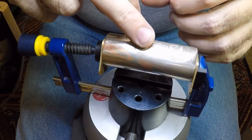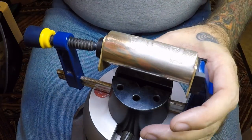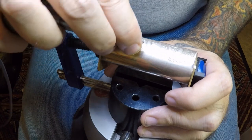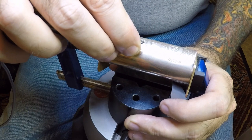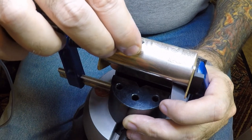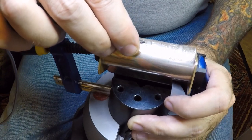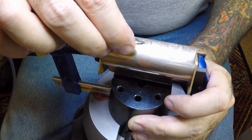You're going to find that towards the end of the cut, which is down here towards the bottom of the piece, that graver gets a little bit more aggressive with the buzzing. That's because I'm actually loading that graver up. I'm forcing it to cut a little bit more metal. So just listen. Could you hear the difference? There you go. That is how you do your shading.